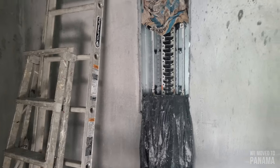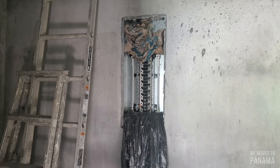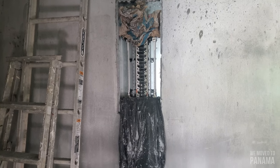Hi guys, I've restarted just bending the PVC piping conduit for the electrician. I'll show you guys here on top what I've done so far. It's a bit complicated because I'm not doing a normal ceiling like most houses are done, where you've got your rafter and your ceiling is actually below it, so it's very easy to run your conduit. So here's the main DB box or power supply isolator box.